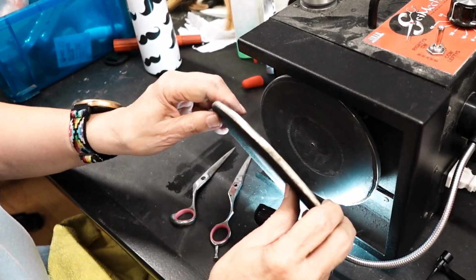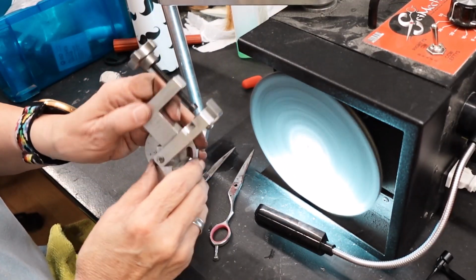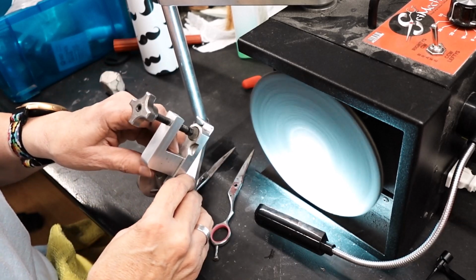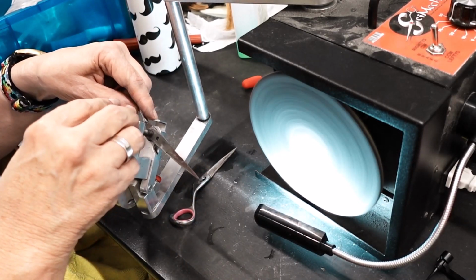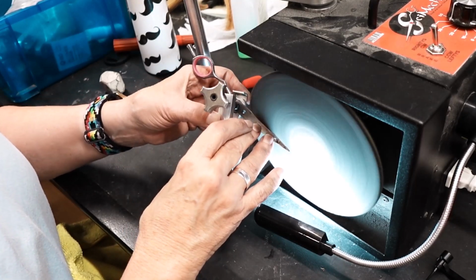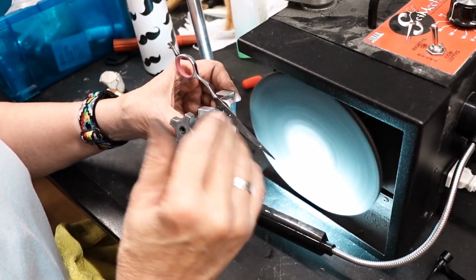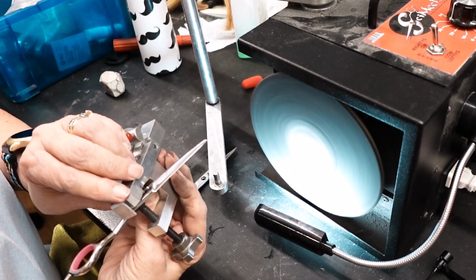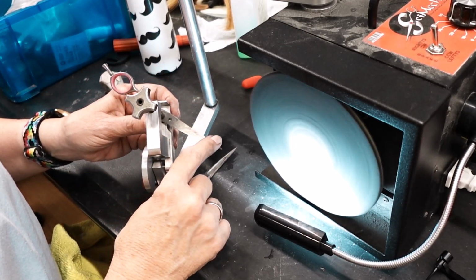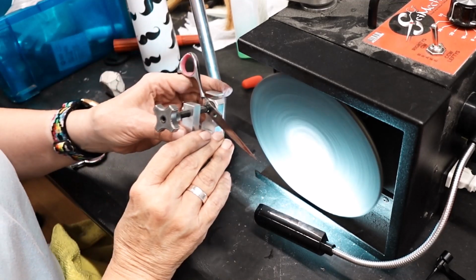It looks pretty bad. Now these buffing pads, the ones I use are made of felt. There's different kinds you can use. And here, this is real key. I turn this little knob here to move my angle from 40 up to like 44. Because I want to roll up to the edge, because I've created some burrs on the outside when I knock that inside burr off, but I don't want to roll over the edge. And I'm doing most of my time back, not right on the edge, but behind, but before I get to the edge. And that angle looks a lot more consistent than it did before, and it feels a lot sharper. Let's hope this fixes it, because this was pretty easy fix.